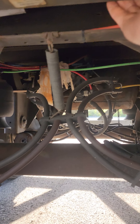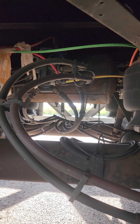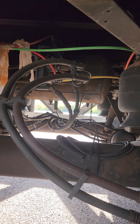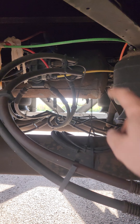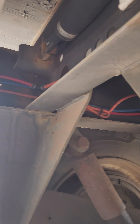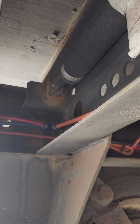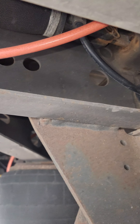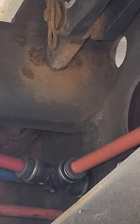Another thing I tell people about air-operated trailers: start with the big elephant in the room, which is your air tank, because that's what moves this whole system. When I hook up to a trailer I put the lines in and then release the trailer to allow it to air up and build air. That's the air tank for the trailer — it's allowing it to fill up with air so it can move. You can see this solenoid — it's a big solenoid on both sides that pulls back when I release them. Also, same thing with cotter pins — they go missing and you can use vice grips to hold the end and move them back in and out.